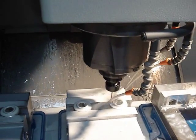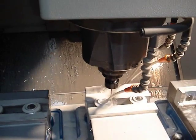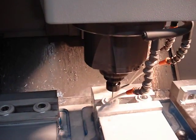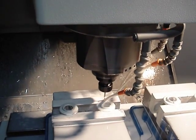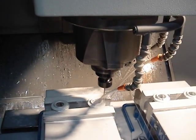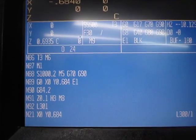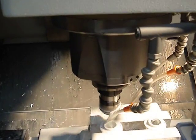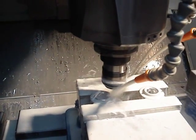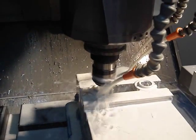The primary operation was on the CNC lathe. First we mark the holes, now we're drilling them — it doesn't take long. This is called rigid tapping; this is how we get that M3 thread in those holes for mounting to the gear.